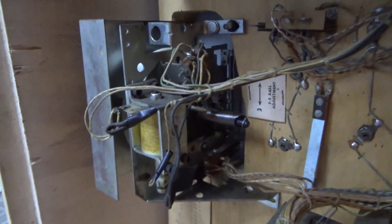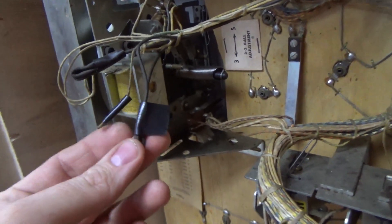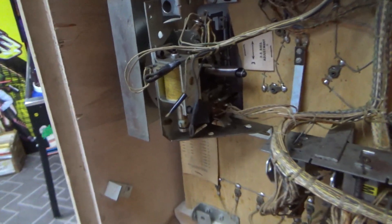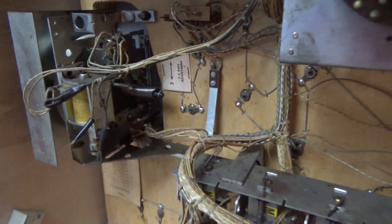And then here is the coin unit — some call it the coin unit, the credit unit, and the replay unit. You can see there are a couple switches here that are disconnected. What they've done is taken away the thing's ability to subtract credits. So once it has credits on it, it can't take one away — it'll never go to zero — because they've disconnected that coil. Very, very smart. They've modified it slightly so that it can't ever go back to zero.